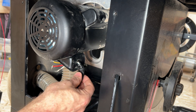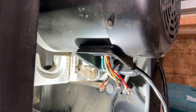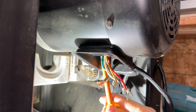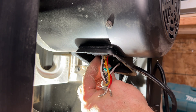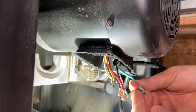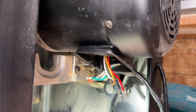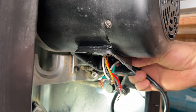My green wire is still connected so I had to loosen that screw. It's really hard to get a good camera angle — there's a little screw up here and you kind of have to get on your knees to see it and do it by feel. There's a tiny little grounding screw and a washer somewhere in there — good thing I vacuumed, that would be harder to find otherwise. Now the grounding wire is free, and you can see it's got a loop on it that the screw goes through. So now the cord is loose and I can pull it all the way out.